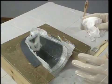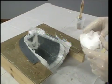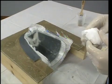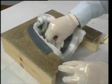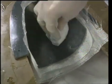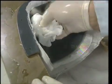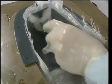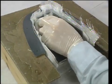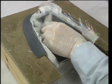Now that we have the laminate completely saturated and wetted out, take an ordinary ball of Kleenex or toilet paper and blot out the excess resin that is puddling in the bottom of the mold. This will help absorb the excess resin — there is no need for excess resin in a part like this because it only adds weight. These two layers of reinforcement behind a single layer of surface coat and putty are all that is used to make the cowling halves.